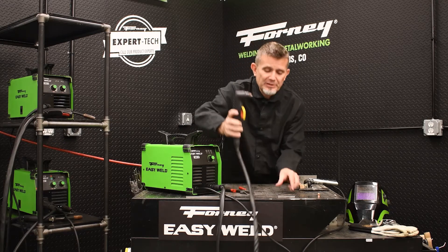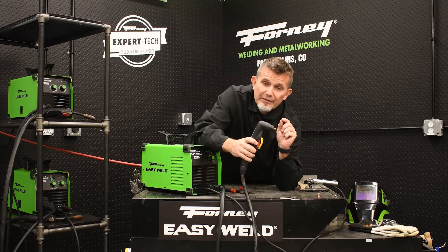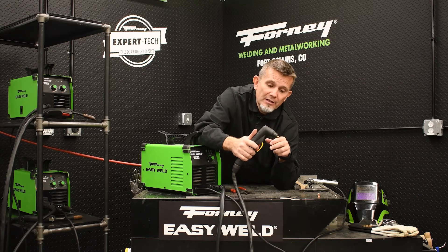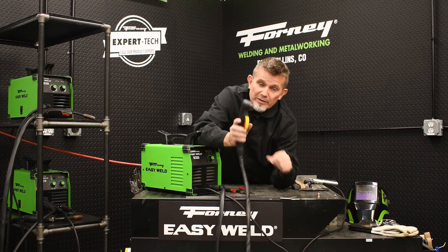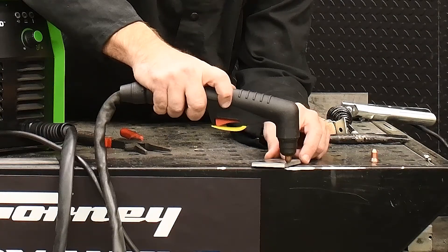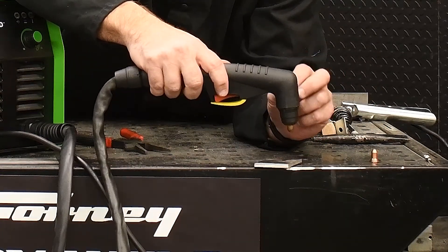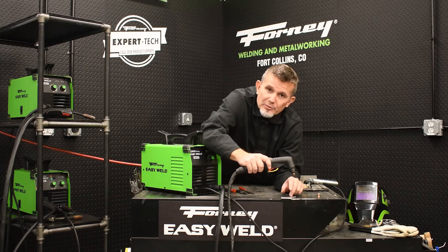So let's take a look at this torch — let's pretend that I'm going to cut this quarter-inch piece of metal. You need to have a contact between the tip and what you're cutting. I can pull the trigger and get an arc for about two to three seconds, and if the machine does not sense a circuit between the tip and what I'm cutting, it will shut down. So what that means is you need to drag this tip across the workpiece. Normally when you're plasma cutting, you're going to start on the edge, pull the trigger, and then pull that torch across. You're going to want to watch the spark trail going through whatever you're cutting — watching that spark trail helps you guide how fast you're cutting. So make sure you have your tip in contact with your workpiece.